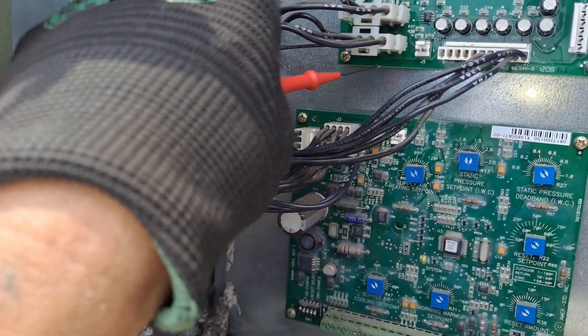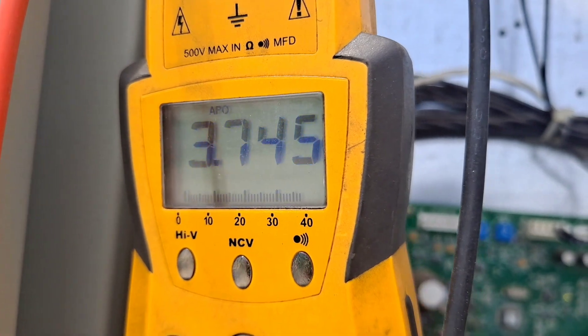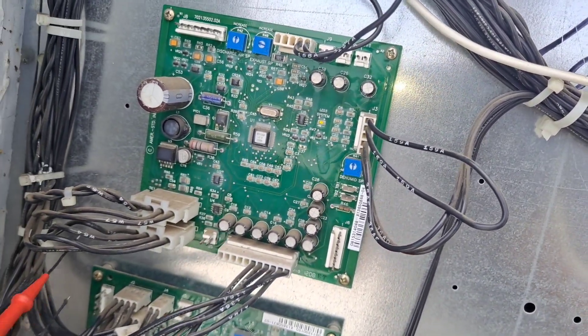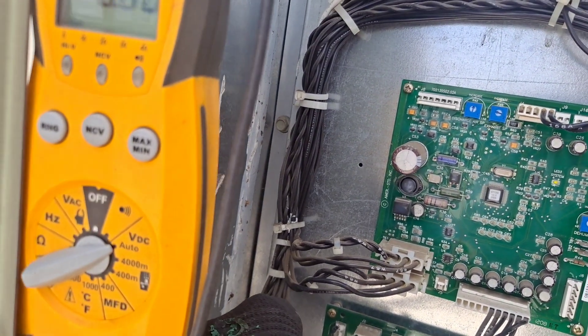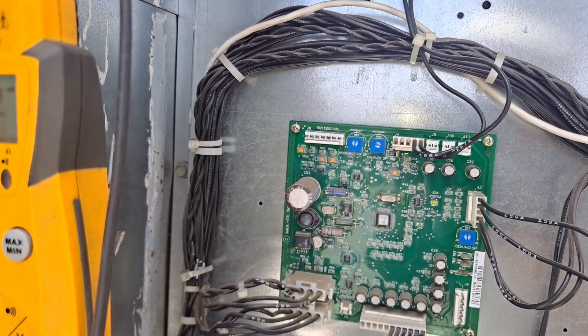And if I take a reading, you can see it's three point seven volts now. This is a five volt output, so that doesn't seem right. I just removed it, and if we touch the bottom and the top pins - which is hard to do with these little needles - bam, five volts.